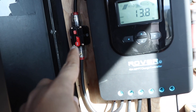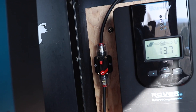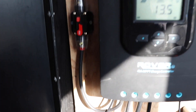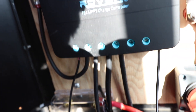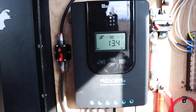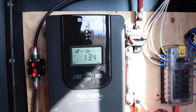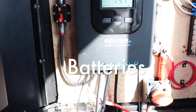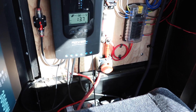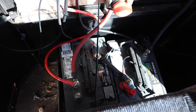I have the positive and negative wires coming through here, and I have it on a breaker switch so I can turn off the solar panels from the battery when I need to work on them, then flip the switch back and it continues giving power. That goes into these terminals where it draws the power in — that's my Renogy charge controller. And over here I also have my power inverter and the batteries down below.